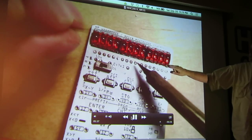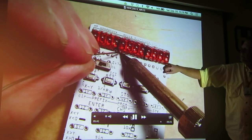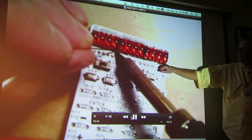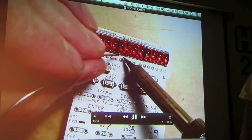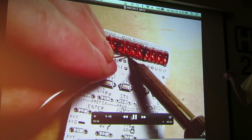As you can see, you've got to solder from the top side. Once you get the back side soldered, these pins are underneath the ICs on the back side, so you've got to go from the front side and actually apply the soldering iron there.